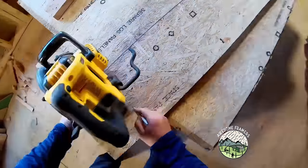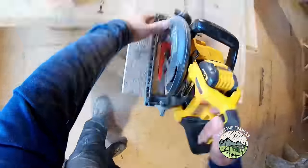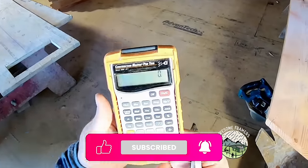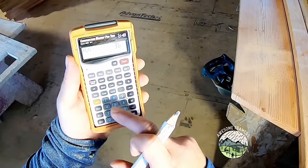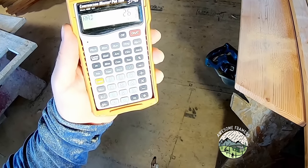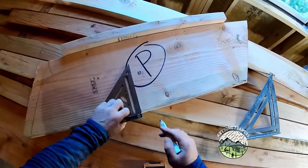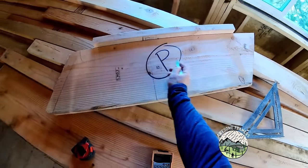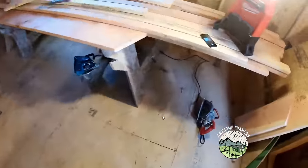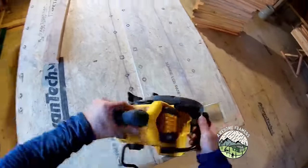Here's how you figure out your radius: I made my rafters 36 inches along the diagonal. 36 inches is the run, I'm going to go 7 inches high at the middle, hit convert arc — 26 and 5/8 is my radius. I have 36 inches at the halfway point; I want the rafter to be 7 inches tall and then basically arc through. The saw is going to fit in like this — my radius was 26 and 5/8, so I'm going to pull about 40 inches off and trim off all the excess material, cutting this direction with the trammel.